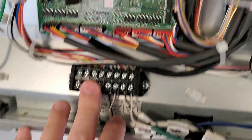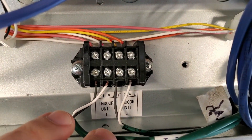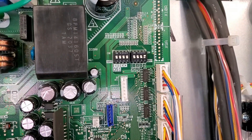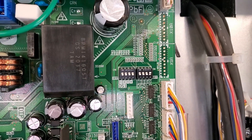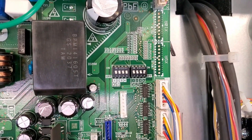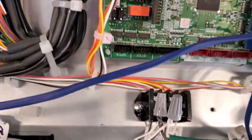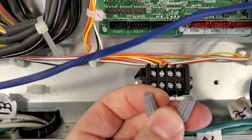Ports A, B, C, D are all being used — all switches off. Ports E, F, G, H are all being used — all switches off. Ports I and J are being used. This is a 10-port box so all DS1 switches are off, and DS2 switch number four is on because the board doesn't know that there are two ports that don't physically exist. We also found a wire nut on port D that needed to be addressed.